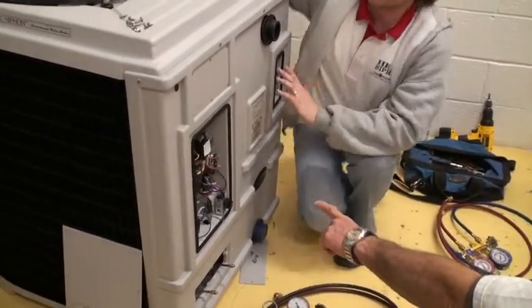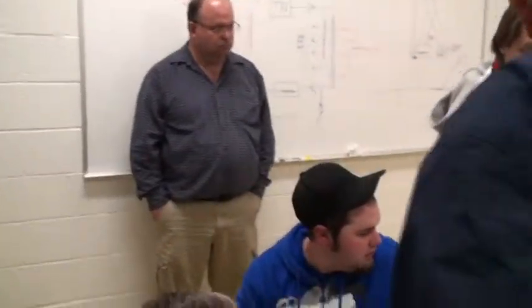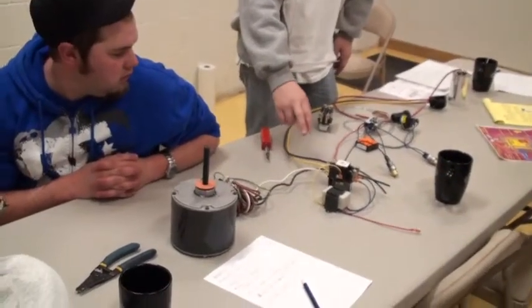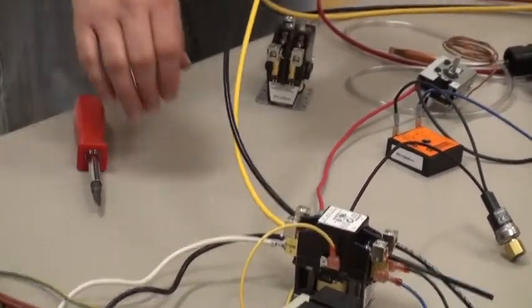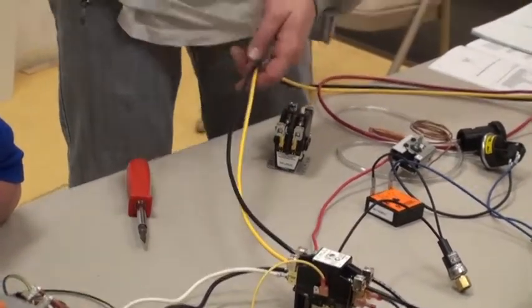There's a trick for the compressor. If you have a breaker tripping, or if you have running but not heating, you can disconnect the wires here and see if it's still tripping the breaker. If you pull these two wires and disconnect it, turn on the fan on them — boom. You connect these two back up and it trips the breaker.